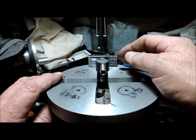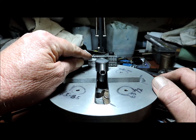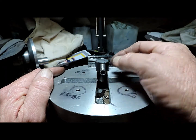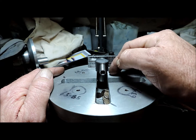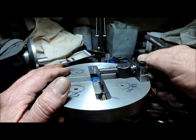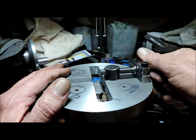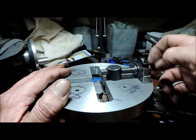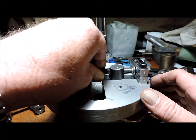I've got one screw in and tightened up. Don't drill, mark, drill, and tap the second one yet — leave that one untouched. Get the first one in, and mine was slightly out of alignment. That journal wasn't lined up with the slot, so I just bumped it around a little bit until that nut travels with no binding over the full distance. When it's all the way in, there's no room for error. It's still a bit loose which is good.